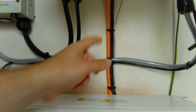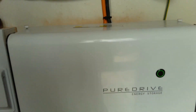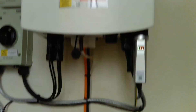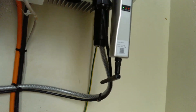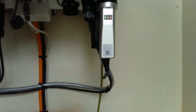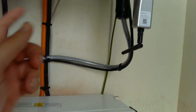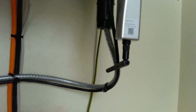Out of the bottom of the inverter we have orange and black cables which go down to this PureDrive five-kilowatt-hour battery. There is also a data cable that links the two so the inverter can communicate with the battery. On the other side of the inverter, this grey unit is a data logger — a Wi-Fi connection — that takes what's on the display screen and outputs it to an app. I'll do a separate video about the app.